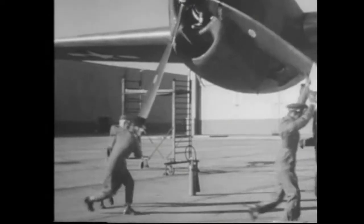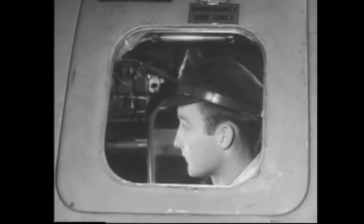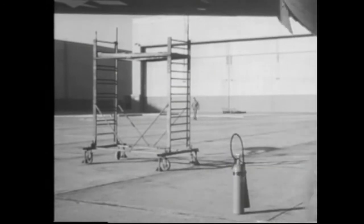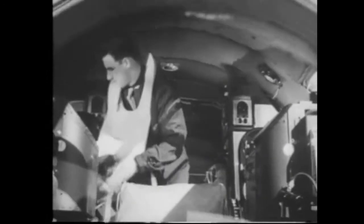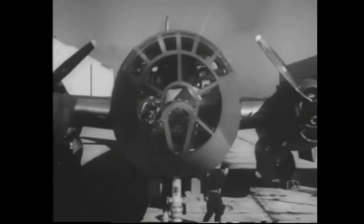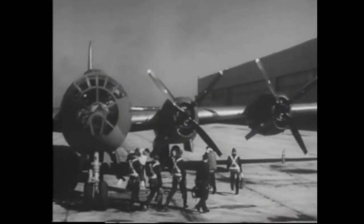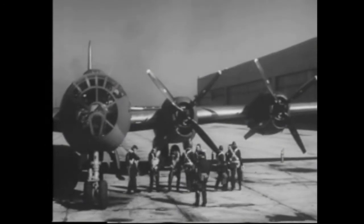And there's still more work to be done. Each engine must be pulled through 15 blades, with only two men per blade. The engineer takes care of that. He sits at his position, making sure that all switches are off, while the four engines are pulled through. Now the co-pilot puts on his clothing and collects his equipment before joining the rest of the crew for inspection. Notice that the crew members wear fatigues while making their inspections, and change into flight clothing only when they are ready to enter the plane. The examination of the exterior of the airplane is completed, so the crew can fall in for the check of their personal equipment — that's the last item of the before-entering-the-airplane part of the procedure.